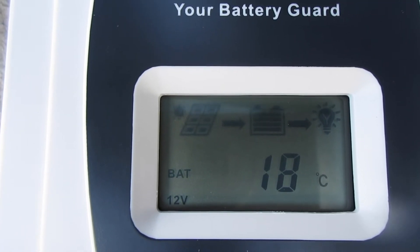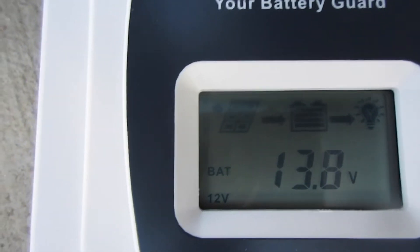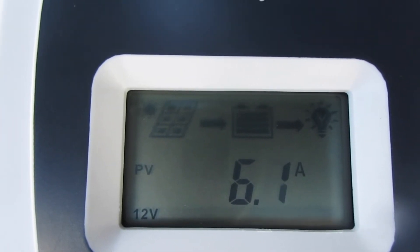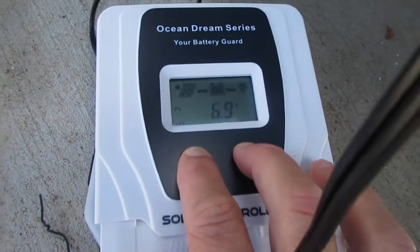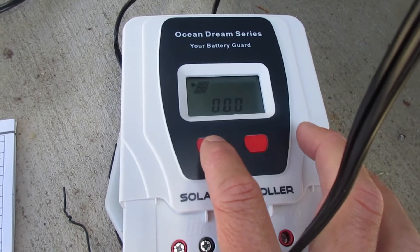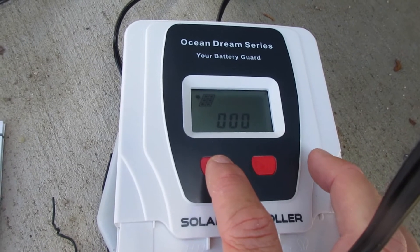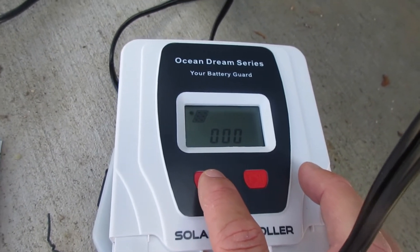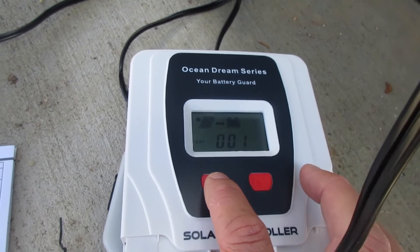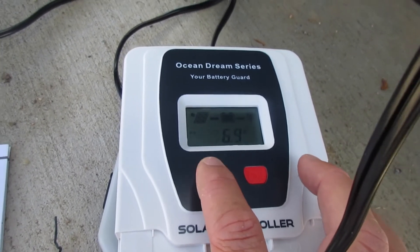As you can see, it jumped up the amps to 6.5 because we must have got a lot of sun all of a sudden. There's 14.6 volts coming from the solar — 6.7, 6.4 amps. This menu is kind of cool. I was looking at the manual, and if you long press both buttons it goes into a new menu that shows you the number of low voltages, which is zero; the working days, which I thought might be how many working days you have but it's showing zero so I'm not quite sure — the instructions aren't so great with this. Number of overcurrent events, number of charge full, which shows one, and then it goes back to your main screen.